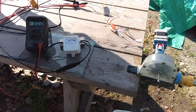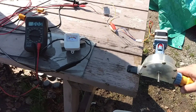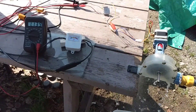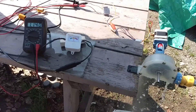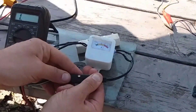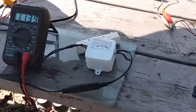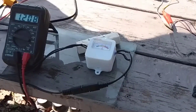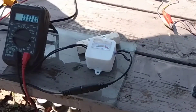For a load test I'm using two 8-ohm resistors giving me about 4 ohms total resistance — closer to the sweet spot where it won't drag voltage down to nothing. My amp meter is one I set up for a solar panel that reads double, so a reading of four amps is actually two amps. I'm getting just over four amps on the meter, which puts me just under two amps in reality, giving a ballpark of about 100 watts — though that seems like a stretch, so I'll conservatively assume about one amp, giving roughly 50 watts, which seems reasonable.